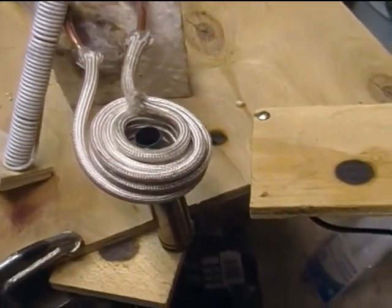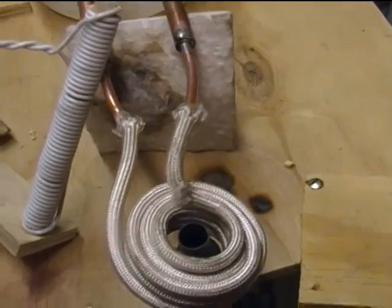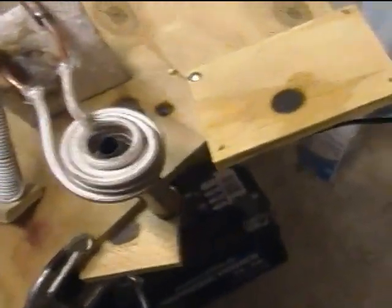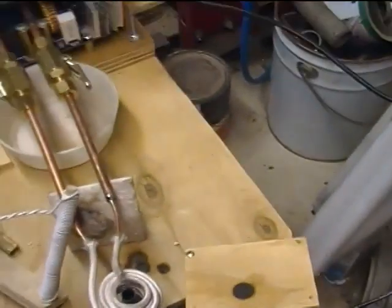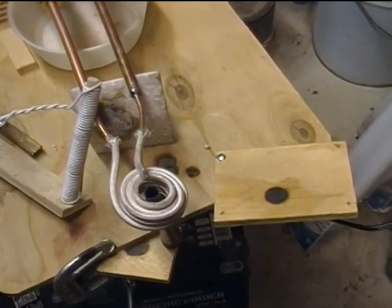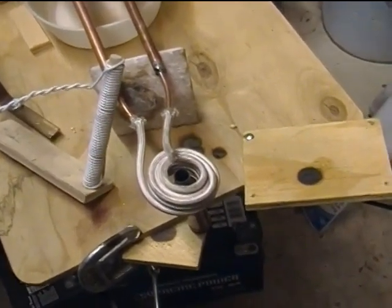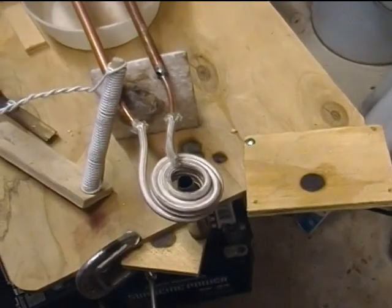I've got a cartridge casing in this new nine-turn, three-layer by three-turn coil made out of 1/8-inch copper tubing. The idle current is about 14 amps, and when there's a neck in there, the current goes up to about 21 amps. I'll count until it glows — one, two — about two seconds. So it doesn't take very long at all to anneal a cartridge with this coil. Maybe that one's good for cartridge annealing, maybe it's too fast. The idea is that if you want to build a cartridge annealer, you can go somewhere between this coil and the other two coils in earlier videos to come up with a compromise that's as fast or as slow as you want it to be.